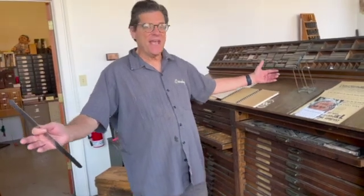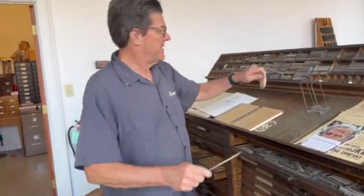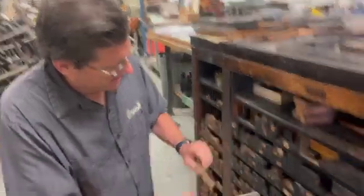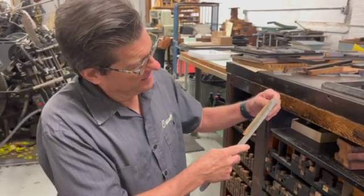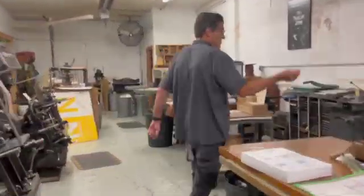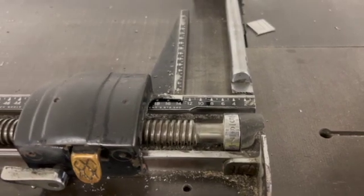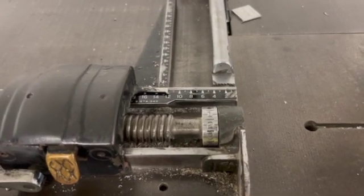So everything is standard. The leadings, 6 point, 20 pica. The furniture, you have your 5 pica, 20 pica. Then you have your riglets, pica width, 31 length. You can even cut. The saw was created for points and picas from 14 points to 12 points.